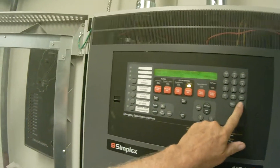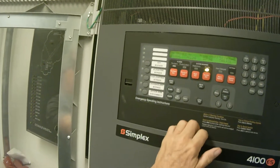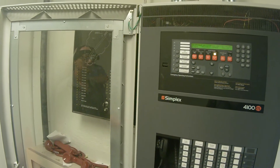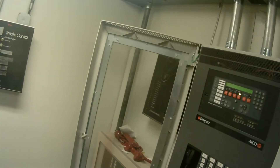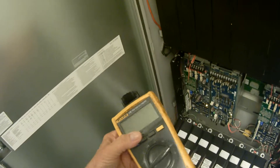By the way there will be a lot of troubles on the panel. This thing's going to take a little bit to settle down because it basically disconnected every circuit through the whole panel checking for the ground, so it has to reconnect. We have 38 troubles and they're counting down. In the meantime we've removed our circuit with the ground fault on it and we'll just take our meter and verify that.